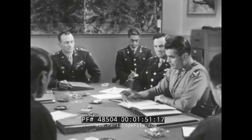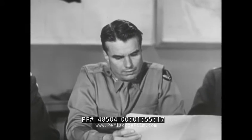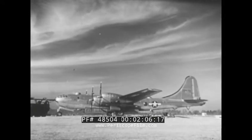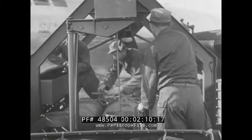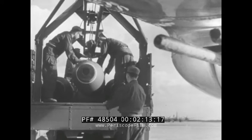Project number F-3607 tested the bomb hoisting and handling equipment of the B-29 airplane. As you recall, General, we ran a series of tests using various combinations of men and equipment. We found that for speedier and more efficient loading of the B-29, it was best to use a five-man crew in each bomb bay and motor drives for the C-3 bomb hoists.